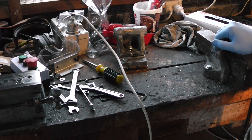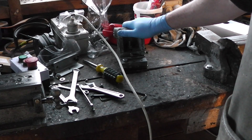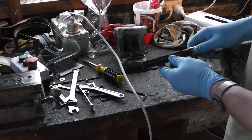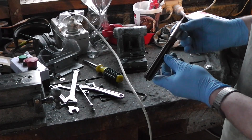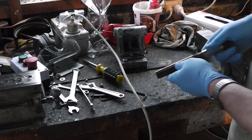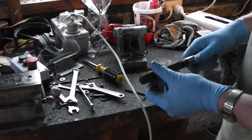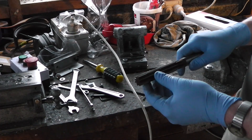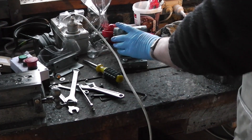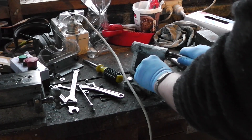Instead of boring it out to exactly 20mm, I'm going to get it to about 19.95mm, and then use a new toy — this is a reamer. It is not a drill bit. You do not use this in holes that aren't nearly the right diameter. What this does is, in the same way I use my scraper to scrape a flat surface, the blades on this turn and scrape the inner diameter until it is the perfect diameter we want. This is a 16mm reamer, and the bore inside here is 16mm — badly. That's how it will work.